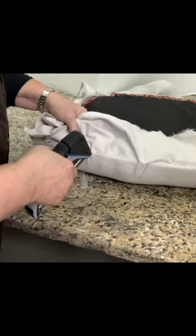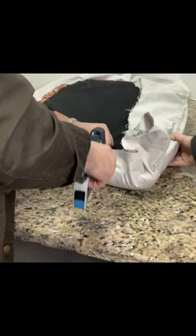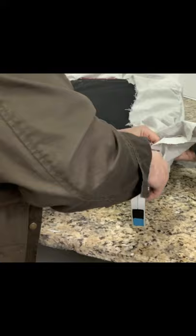She's pulling really hard on this fabric to keep it nice and taut. You have to put a lot of staples — you have to put them touching each other — you want it to hold. Just keep on going, keep going all the way around.